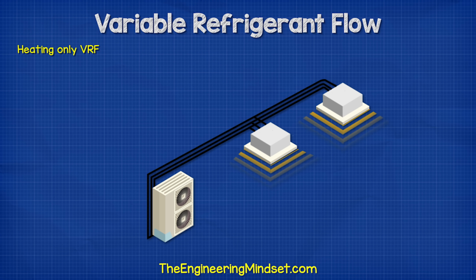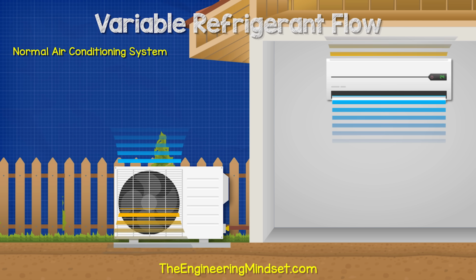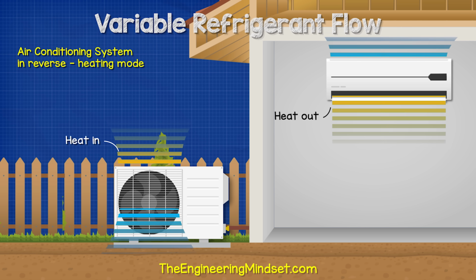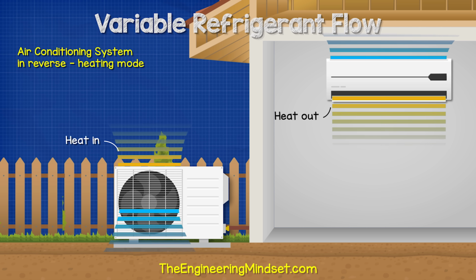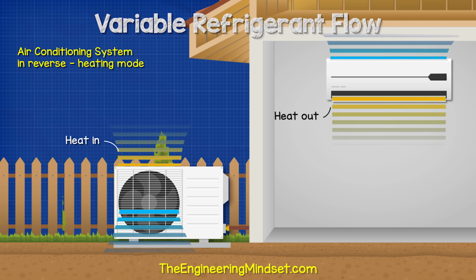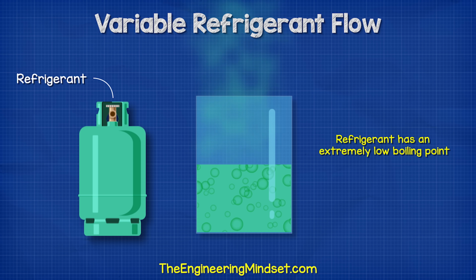Heating-only VRF systems aren't very common, but they are essentially just an air conditioning system running in reverse, absorbing heat from the outside air and transferring this indoors. So this is basically just a heat pump. But how would this work in winter when the air is cold? Well, the refrigerant has an extremely low boiling point.